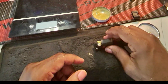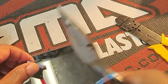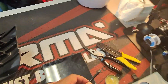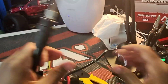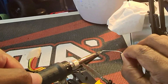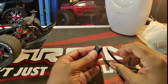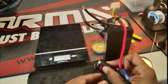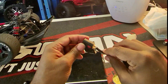Good tin going there. So now we're ready on this side. Now we got to get this side ready. Put a little flux on it and then tin it. Tin job complete there. We can slide on the protector cover. And then we're just going to put this negative onto this negative side — just like that.